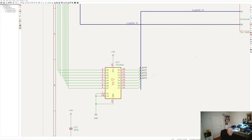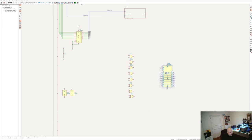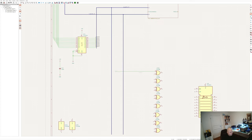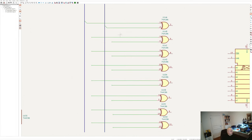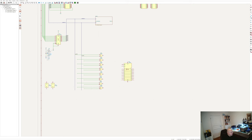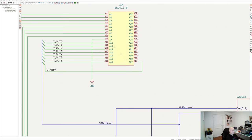Next, I also have a lot of logical operations like XOR, AND, and so forth. They are pretty simple — you take enough gates: for XOR operations you need eight XOR gates, which means two packages. Don't forget about power and decoupling capacitors. Extract the signals from the bus, connect them to your XOR gates, and then connect the outputs to a controllable open drain buffer, which allows connecting several buffers to the same bus and physical wires safely.